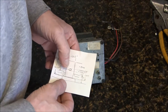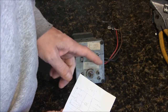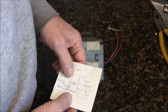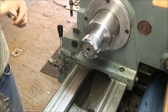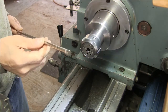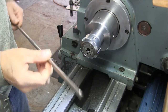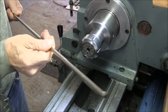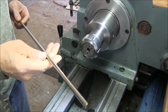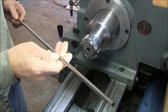The Hornady has a roll pin in it. I'm going to use that to hold the shaft adapter onto the shaft — I'm just going to through-drill both of them, and when I drive the roll pin in, that'll hold it. I went to a flea market a while ago and some guy had torn apart a bunch of printers, so I got a whole bunch of these stainless steel rods for like five bucks. It just so happens this is exactly the right diameter to make the shaft adapter.